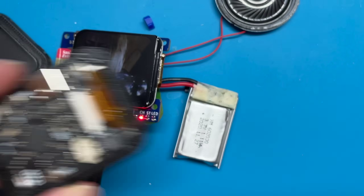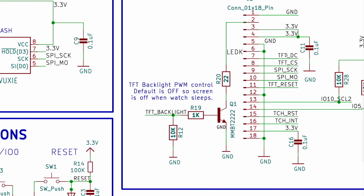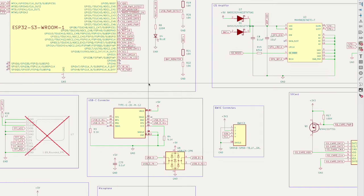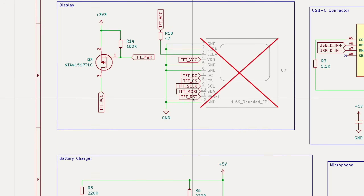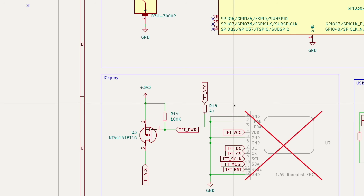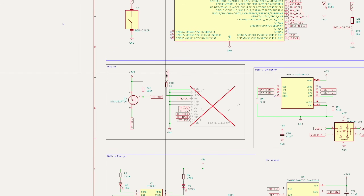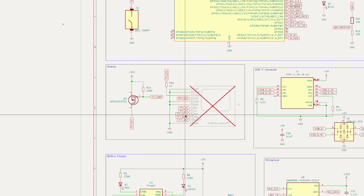The issue is, if we look at the schematic for the Tiny Watch, we need nine pins to control that screen. My current screen only needs six pins plus maybe one for turning the screen on and off, and we probably need a power control pin too - so actually ten pins total. I need to find another four pins to drive the touch version of the display and have a nice connector. One option is I currently have several separate power controls for the TFT, IR, and SD card - those could probably be combined onto one control, freeing up two pins.